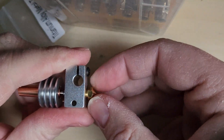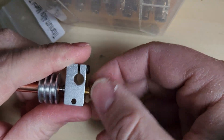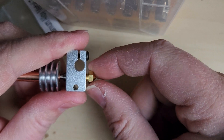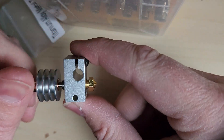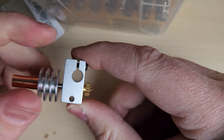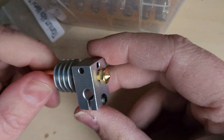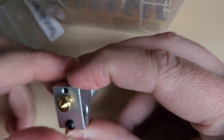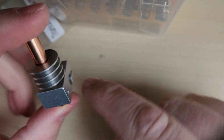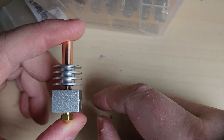So the best way, like I said, is — and again if we look at this, there's a threaded portion and then there's not a threaded portion. So we put that in there like that, tighten it, and away we go. This screw here is for the thermistor and then the heater cartridge. On the Mingda, you want these coming out on the correct side.